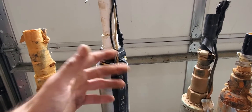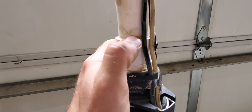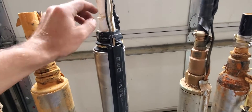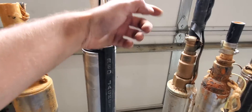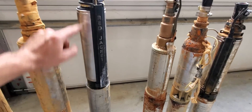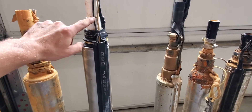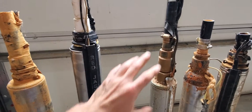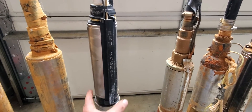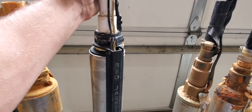This pump is on white PVC pipe. They were still getting some pressure but it would always stay around 15 or 20 PSI because the pipe itself had cracked. It's still sending some pressure toward the house, but most of it is shooting out as a spray and circulating back into the pump. That's going to stir up a lot of sediment — grit, dirt — and your water could become cloudy.